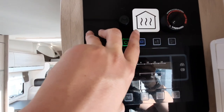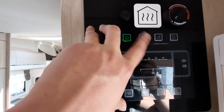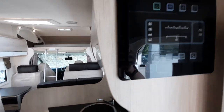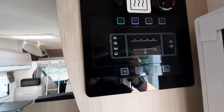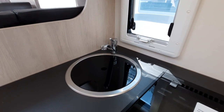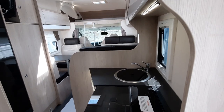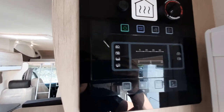Next along is your pump — click that to activate the pump. Important: only activate the pump when you've got water in the system. When you get onto site, click this button, then go to all your taps including the shower, turn them to hot, and turn them on. That will pull fresh water from your freshwater tank into the boiler, priming the boiler and the pipe system. It'll splutter, and when it runs steadily you know you've primed your system. Once done for hot water, flick it to cold and do the same. When it runs steadily, you can leave it — you don't need to turn the pump off. All your taps are on isolation switches, so the pump will only activate when you need it.